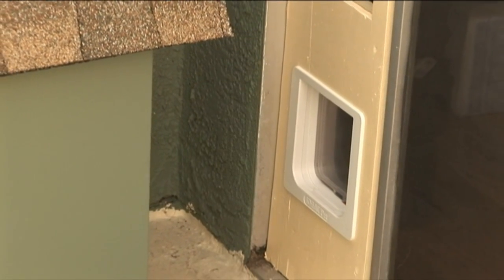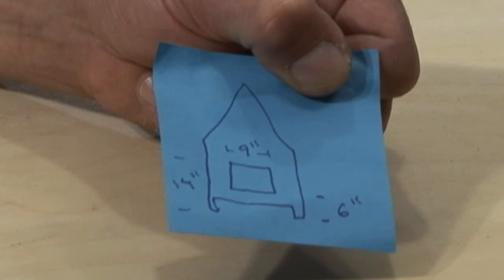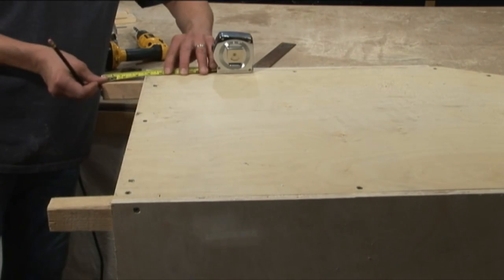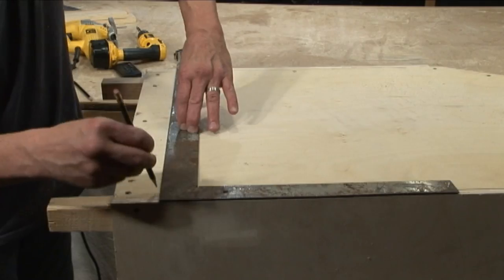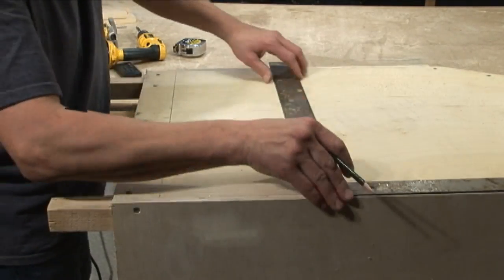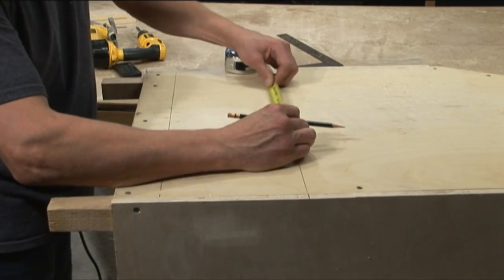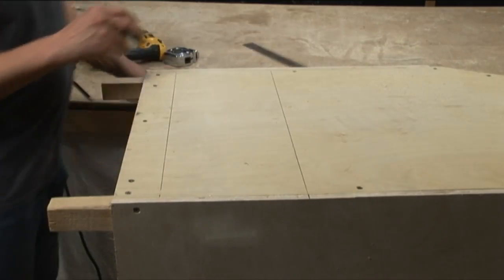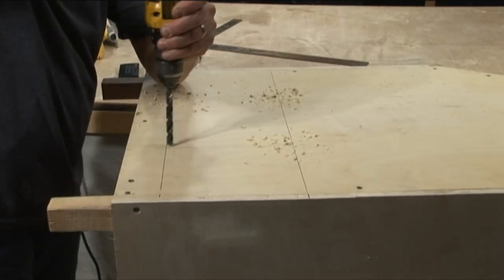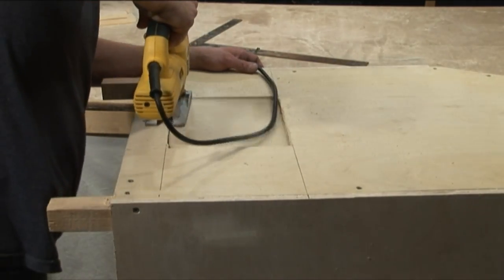Every cat house and pet door is probably going to be at different heights and locations, so make sure you get a good measurement of where your pet door and cat house line up. In our case, the opening will be centered at 9 inches, coming 6 inches off the ground and topping off at 14 inches. Measure up from the bottom of each leg at 6 inches and make a mark, connect the dots, then measure up to 14 inches. Find the center of the wall and measure 4½ inches off either side to give a 9-inch wide opening. Box out those marks, drill out the four inside corners, and jigsaw it out. Clean up your corners and cuts with sandpaper.